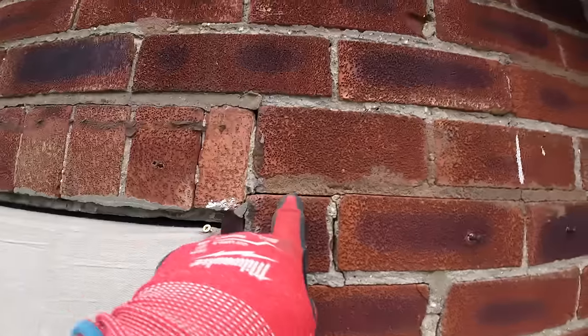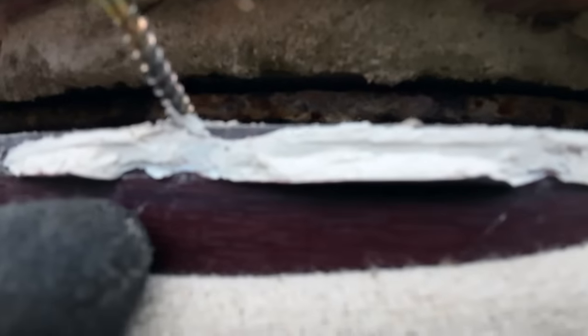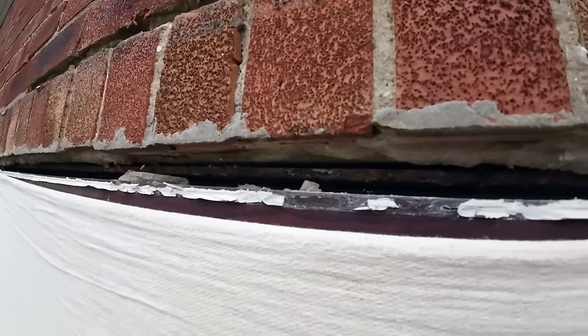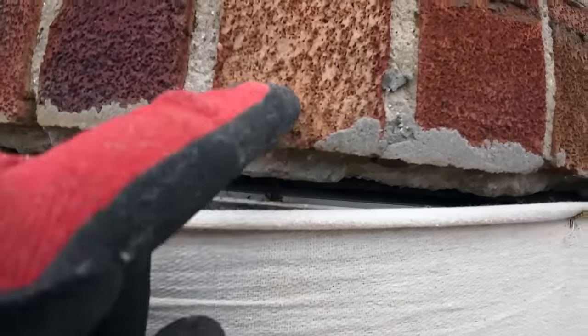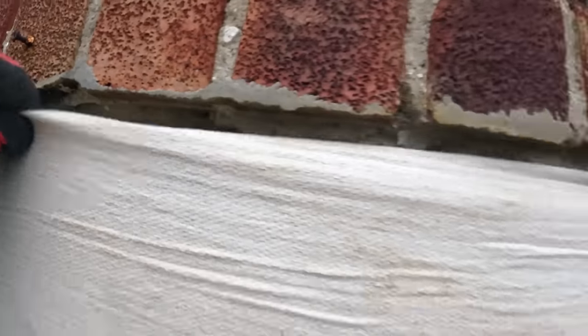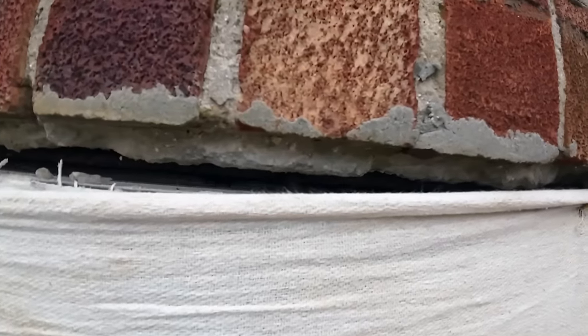So, this cracking is because there is a lintel in there. Just make it out there. Just about see it there. And some of this brickwork isn't attached to it. I've just spotted that. So it's got a rusty grabber holding the frame up to the lintel, so that's got to go. I've just noticed that I've been setting up my dust sheet, so I just need to get the Sawzall on that, get that cut off, and then we can crack on.